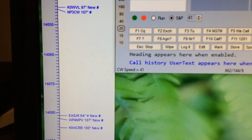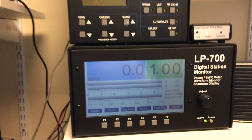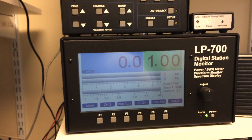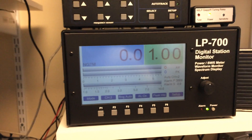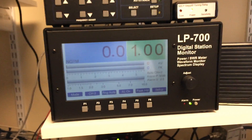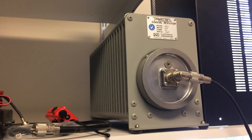It'll be nice. I haven't really tried it at full QSK yet — just got the mod complete. Along with that, I've got an LP700 here with two couplers, so I can monitor the input and output of the amplifier. We'll get the true wattage in and true wattage out, as far as the LP700 rating goes — its accuracy, which is not bad. And then just driving everything into a Bird 8401 dummy load up here.